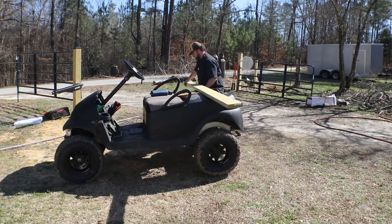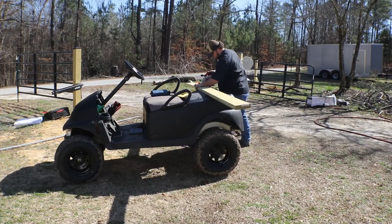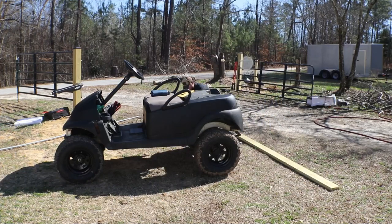And go ahead and measure out what you need for the distance between the 6x6 post and the 4x4 post, keeping in mind that you're not going edge to edge, you're going center of post to center of post. That way, if you need to come back and build another post off of it, you've got somewhere to screw on the boards in the future. It's a good habit to get into so that you're not messing it up down the road.